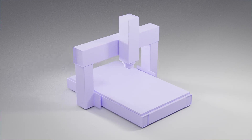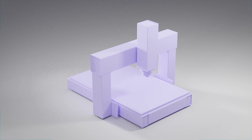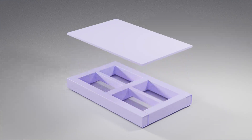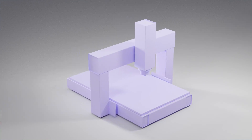Moving bridge style — pros and cons. One significant pro is that the bearings are subject to a much lower lever ratio because they're down at the same height as the workpiece. The machine base can also be much simpler, basically just a big flat rectangular shape to support the gantry. And being a moving gantry machine, the design is weight independent of the workpiece. You can also fit a lot of workspace inside a small machine. One disadvantage is that the whole gantry system will be quite heavy, because you have to move the columns, the gantry, the Z-axis, and everything attached.